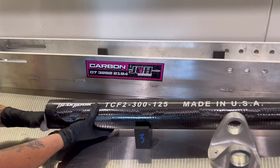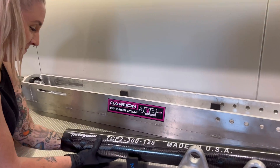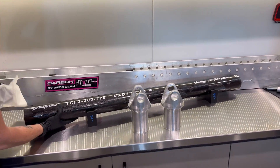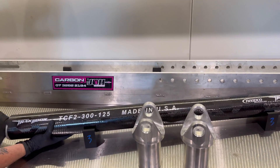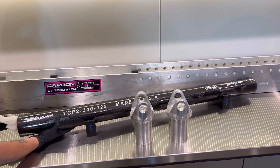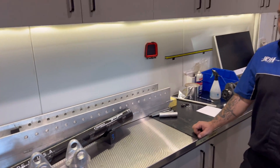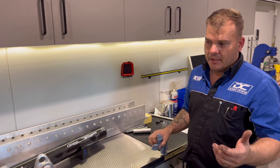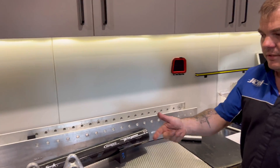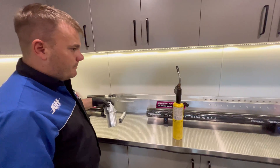When it comes to the cleaning stage, I can't get my big mitts inside the three inch tube, so Amy steps in and takes over. This is cleaning it, preparing the surface so the glue has something to grip. We do everything in this room - it's 22 degrees in here all year round, perfect conditions, no dust, no humidity. Any contamination in the tube or the aluminium and the glue won't stick - that's when you'll hear of an end spinning. We've never lost an end yet.